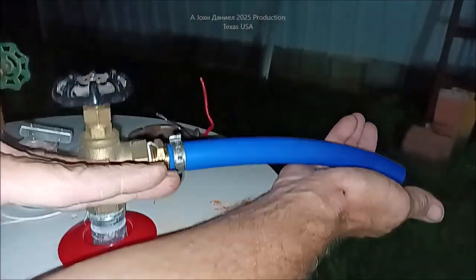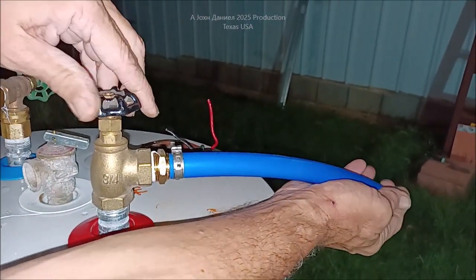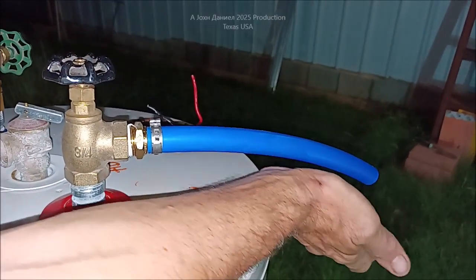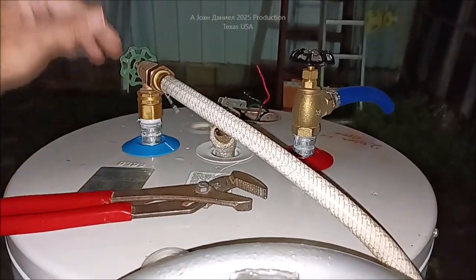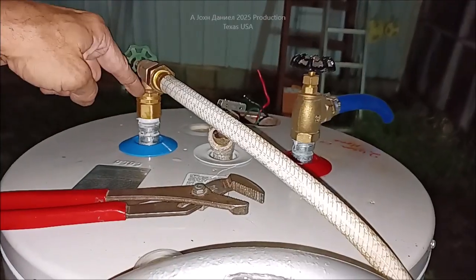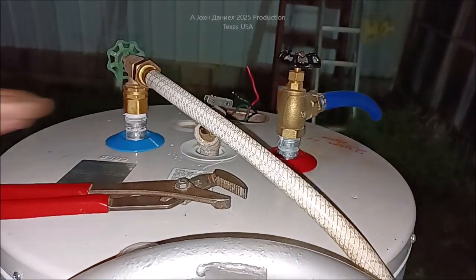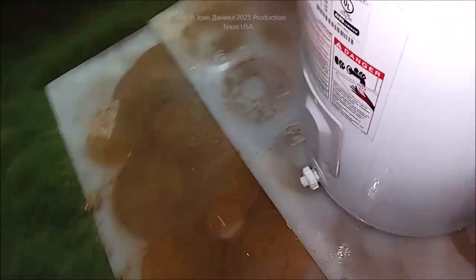You can just put a T on this if you want — you don't have to use a valve. I use a valve when I purge out people's water lines or water heaters. I'm going to crack this open until I can just barely hear the air, and that way this will start to drip when it fills up. Why are we using the cold side? The cold side is the side with the dip tube — it's a long plastic tube that goes past your heating elements down to the bottom. So the CLR she just poured in is going to stir up and spin around in there, scouring the walls where it's really bad at the bottom. It's quite similar to purging your well out.